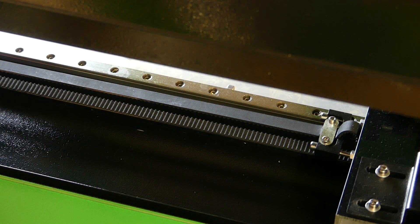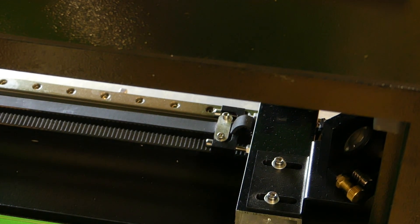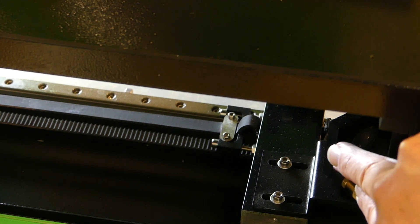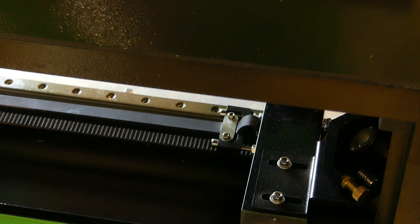I could even loosen the other side a bit, making that side drop down a little bit. So I could maybe let go of 0.2 millimeters on the left side and tighten just 0.8 on the other, and then I should be pretty much perfectly aligned again with the x and y axis. What you can see here is the mirror attachment — of course I'm going to have to work on that to get the mirror adjusted so it hits on the laser head again.